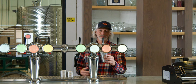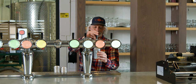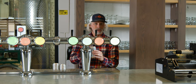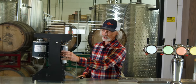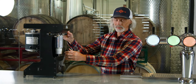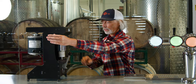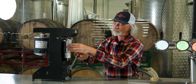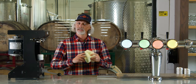Now I'm going to fill the can right from the tap. There is a little off-gassing, so you lose a tiny bit of carbonation doing this. You should be using a cold product, but not too much loss. Then I'll put the lid on by hand and walk over to my seamer. The seamer has a lever that lifts it up onto the disc that spins. We have what we call the first operation that partially seams it, and then the second operation that fully seams the can. Once it's seamed, we like to give it a little rinse on the top to clean it up.